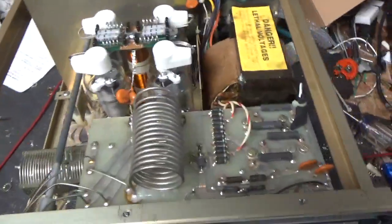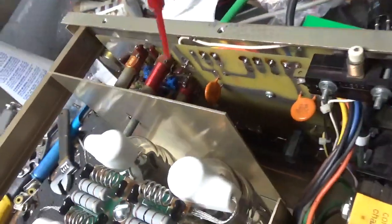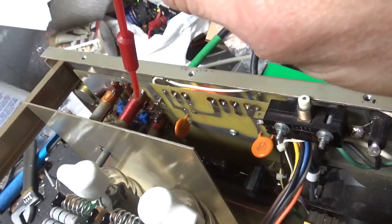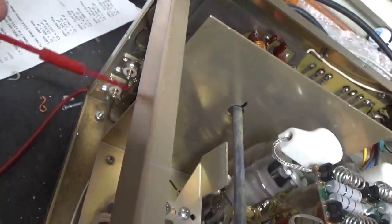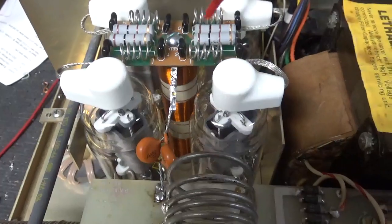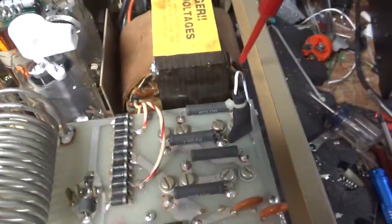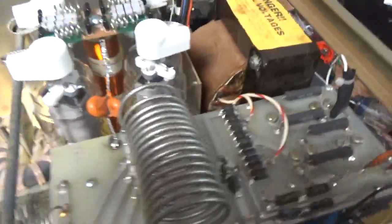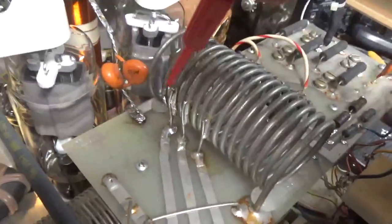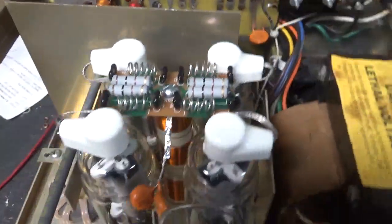Back with the inside of the amp. I fixed that wire issue in the back. I replaced the ferrite slug and mica caps for the 10 meter input. I tuned three of the input slugs. I replaced the SO239s with high quality ones from Max Gain Systems. I cleaned the TR/bias relay contacts. I replaced the parasitic board and the plate choke. I put the proper solder tab connection in for the plate blockers. I did the bias modification, added the diodes to the rear board, grounded the grids right to the metal, and added the gas discharge tubes. I tightened up hardware, fixed solder joints, relocated the LEDs inside the meters, replaced the switch, and fixed the tap for the coil. Tested it on all bands and she's good to go.